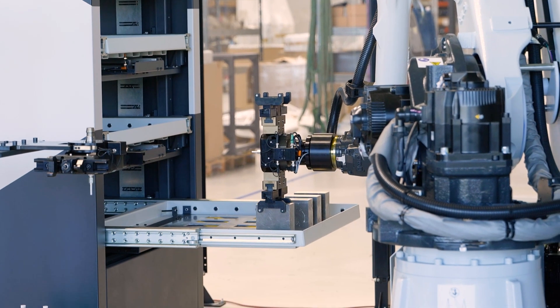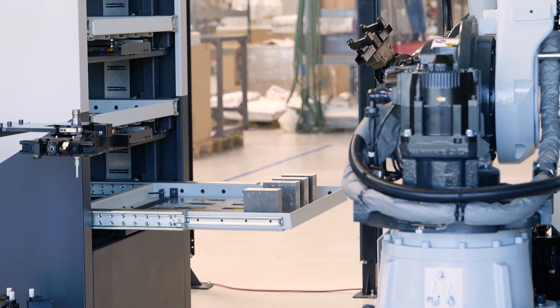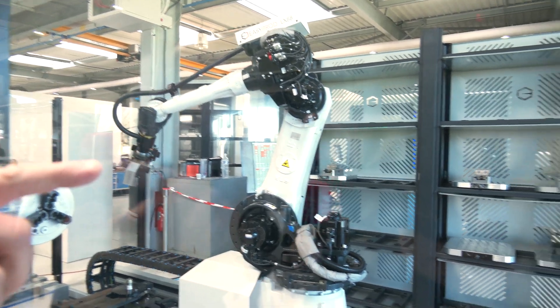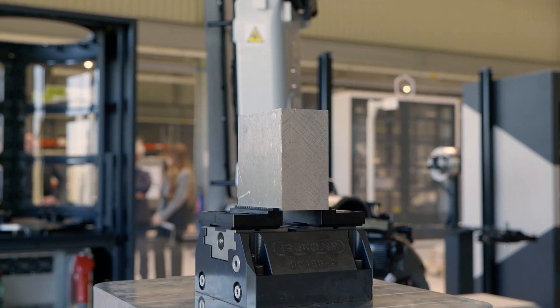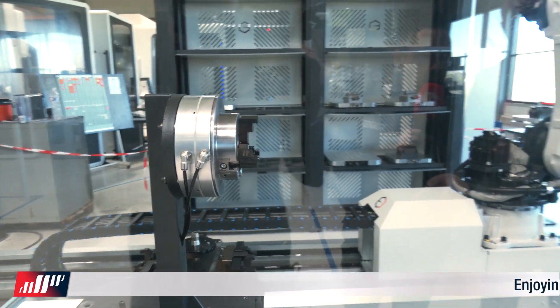I can see the palletisation at the back there. Is this feeding milling machines and lathes? Tell me about the palletisation side and how it would change from grippers to load billets and to palletise. Well, you've got the shelves with all the different pallets, and that over there is replicating a CNC machining centre — a milling machine. These pallets will load onto that machining centre. And over here you've got all the parts in this box, which will be loaded with the grippers onto the CNC lathe chuck. So this is a complete cell representing different machine tools — the chuck represents a lathe, and the zero point station represents a milling machine.